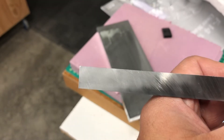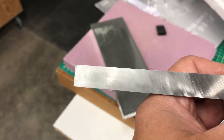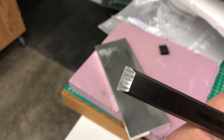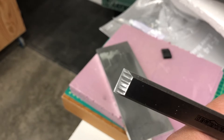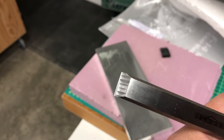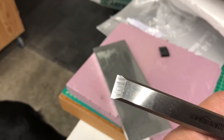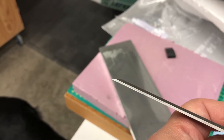So you can kind of see I did a little flattening on it - looks like I need to do some more, but it made a difference. Then I thought I'd just do the primary bevel. Looky there - the primary grind was not really particularly great. This is just a 1200; I didn't go to some ridiculous higher grit or strop it with anything. Dang, it cuts better! So yeah, this stuff actually works. I think I'm gonna get one of those chisel guides.